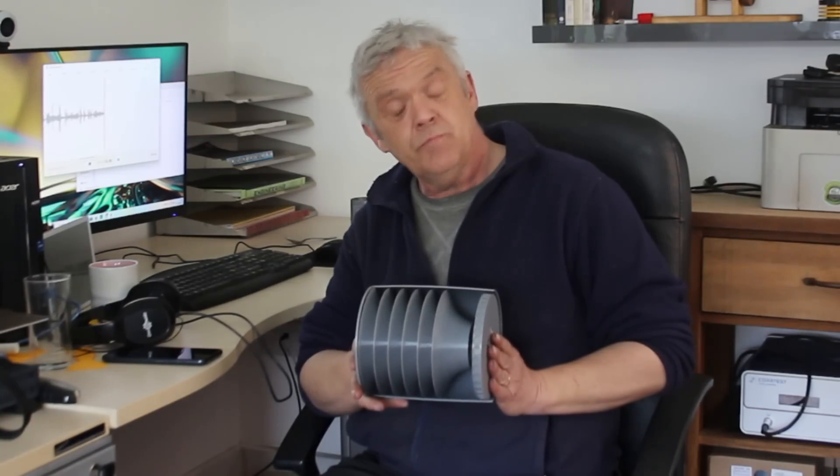Though I'm thinking about this in terms of boats, you could put this on your roofline. Unlike normal wind turbines where energy output is proportional to the swept area, with this design the relevant area is where the air is hitting the cones. The more of these you stack, the stronger it's going to turn — which is pretty cool. The design is in Tinkercad and the link is in the description below, so you can pick up the files, give it a go, maybe change the size or do a whole range. That is the concept turbine for boats, and it looks like it's going to be pretty good.